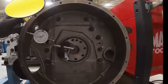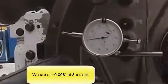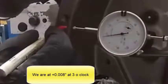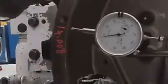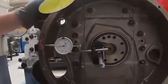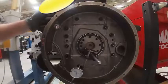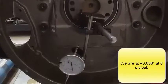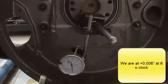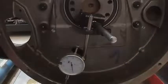Keep going. About there. You can see we're at 8 thousandths right there — that'd be plus 0.008. Keep going. If it gets any worse, we're going to have to fix it. A little more — that'll work. There we're at, about 6 thousandths, so 0.006 plus.